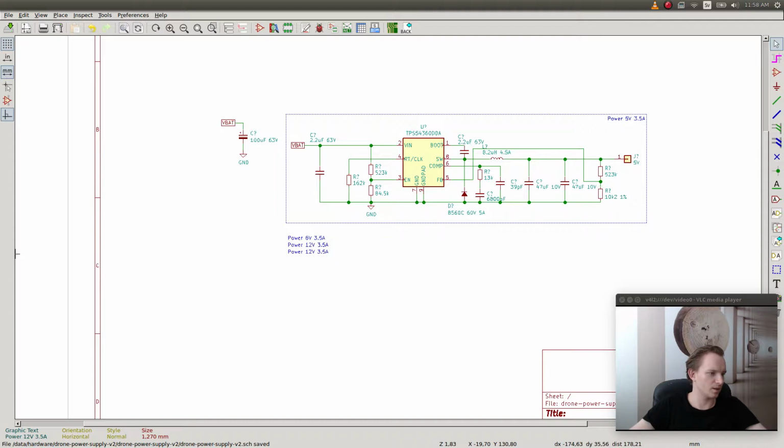I'm gonna check my requirements document. I think we'll just do with 6, 5, and 12, and then we'll make sure that these regulators can be stacked so that you can have more of them if you decide to do that. And it's going to be a rather small regulator. We're going to try to cram everything into a very small space. And if another regulator is needed for 19-volt later, then we can design it separately.